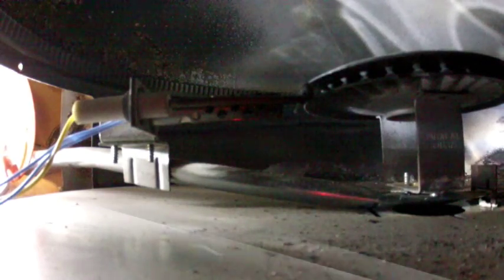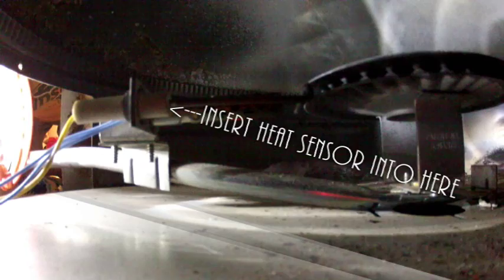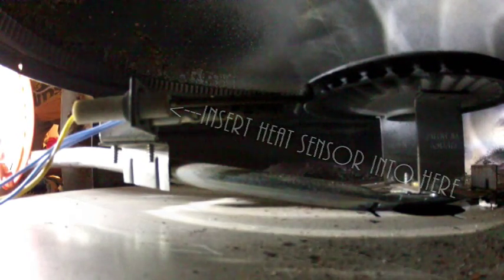See how it goes back in there — you can see where the igniter is. You put it right at the mouth so that it senses in the correct direction. I think what happens is it starts to glow and then a little sensor sees it and tells the machine that yes, there is flame, and it will allow the gas to continue to burn and you'll get hot water.